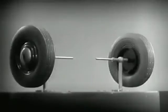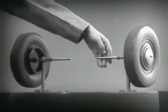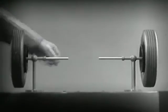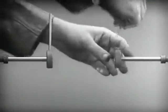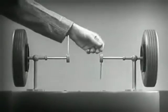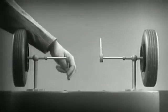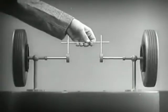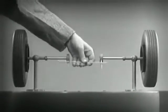It is amazingly simple. These two wheels are mounted on separate axles and supported by a frame so that they can revolve freely at different speeds. By fastening a spoke on the inner end of each axle, we can turn each wheel separately. With a bar or cross piece we can turn both wheels in the same direction at the same rate of speed.